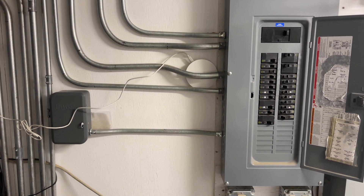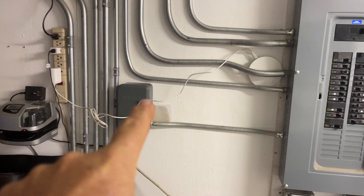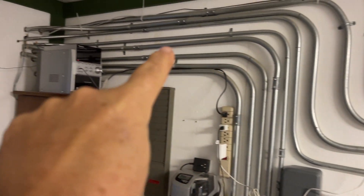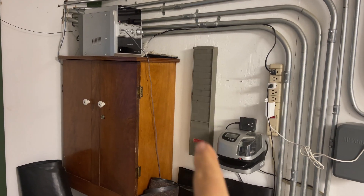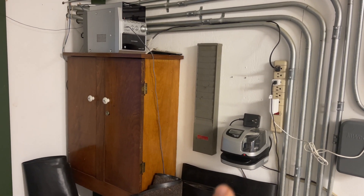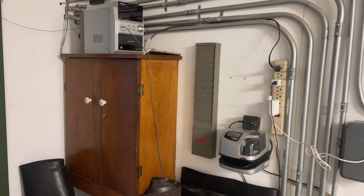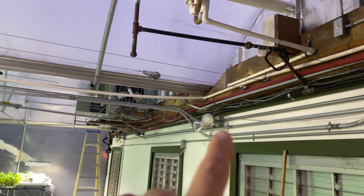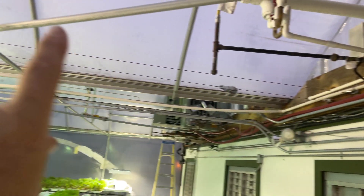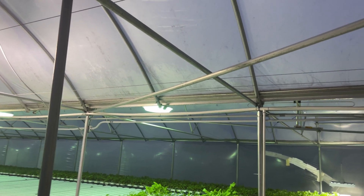The plan is I'm going to come off this electrical panel right there and bend some new conduit. We're going to go up and out into the greenhouse. This cabinet's going to come out, and I'm probably going to take out this time clock too, so that we can mount the control panel right there for the lights. We're going to run some conduit — either up and across or maybe just run it underneath the gutter there — and then I'll run feed lines.